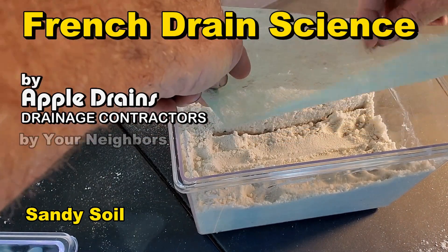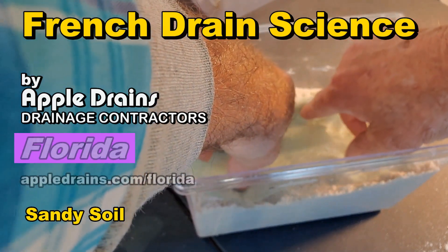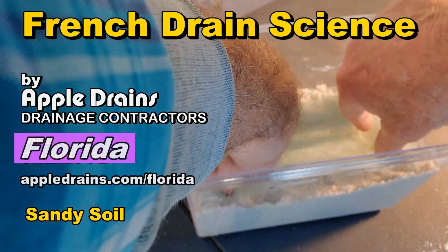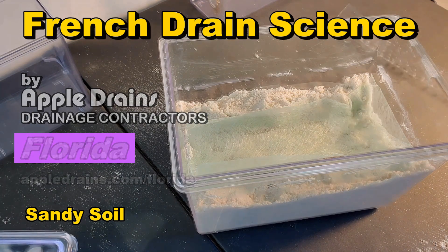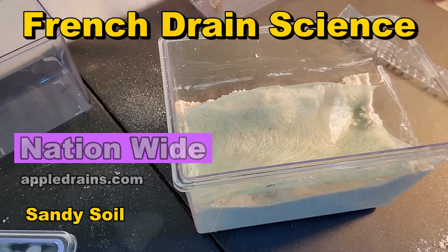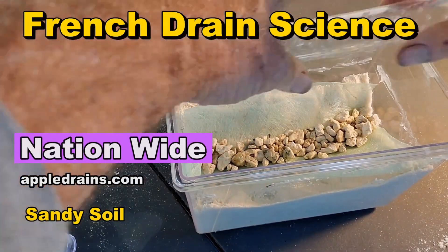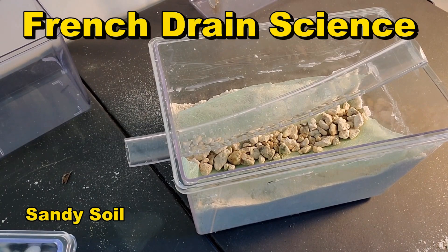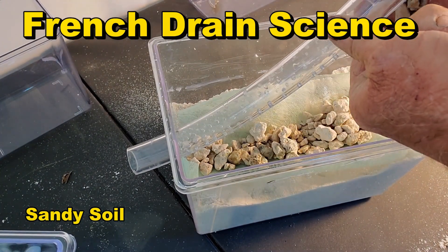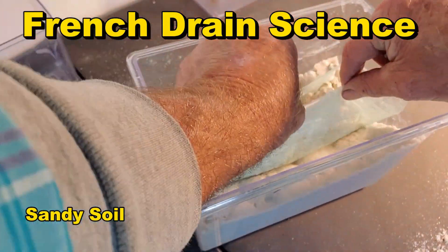We build a little trough. Next, we lay some fabric in there. This is a fabric I found that works so well — better than any fabric I've ever used. It's called Stay Green; I'll put the link in the description box below. Here in Florida, we definitely need to wrap our systems with some type of geotextile fabric, and that's one reason I like to use the EasyFlow — it comes self-contained. We're going to add a layer of gravel under our pipe. This is very important. The base of gravel under your pipe actually makes your system work extremely fast. Okay, cover this up and we'll start this experiment.